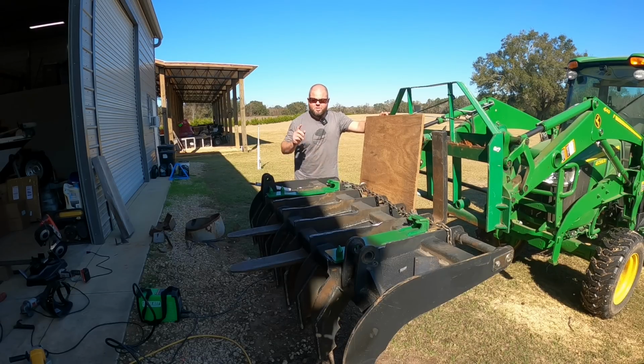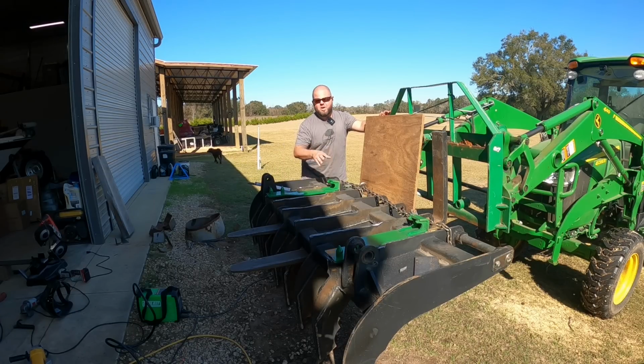I wanted to mention I'm using the stick welder right here. People probably wonder why I'm not running my MIG. It's because there's so much old grease, grime, paint, everything on this, plus there's still paint on these pieces right here. I've ground a lot of it down as best I can, but nothing penetrates through all that stuff and gets as solid of a weld, in my opinion, as some good old 1/8 inch stick welding rods. So I'm gonna stick weld this out, and I may MIG weld the last of it, but I wanna get that good penetration of a stick weld.